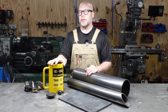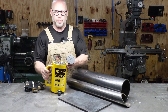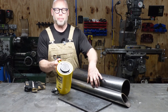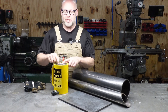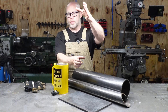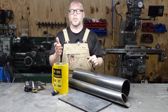They almost want to fit — I think that seam is just taking up the extra material. We also have this little puck that came with the cylinder; this is the head that presses and it fits right in the top of the cylinder. We're going to leverage this and fit it to our pipe to give it basically an extension of the ram. When this is hanging upside down at the press, the ram is going to extend and this pipe will extend that ram, connecting it from the ram to the actual press body itself, pushing downward.